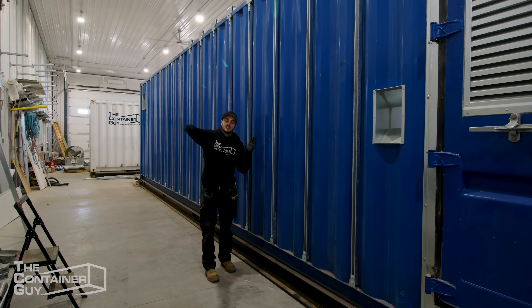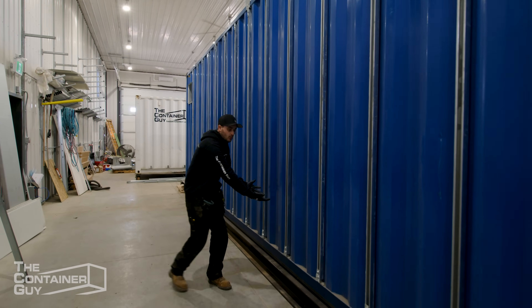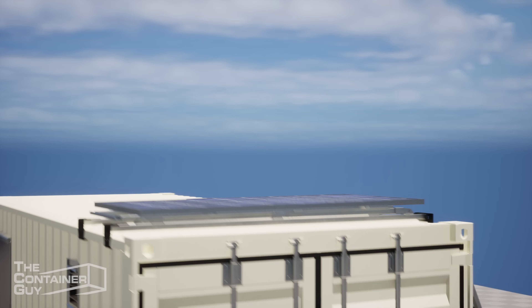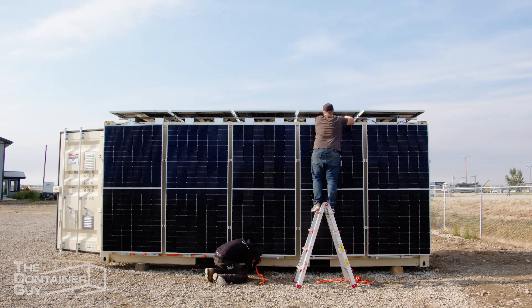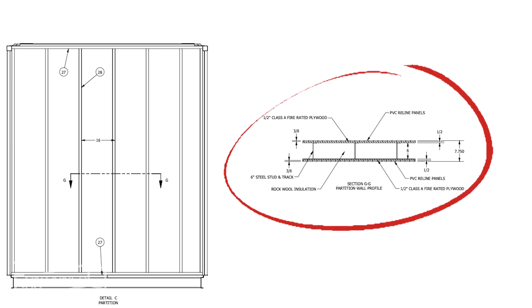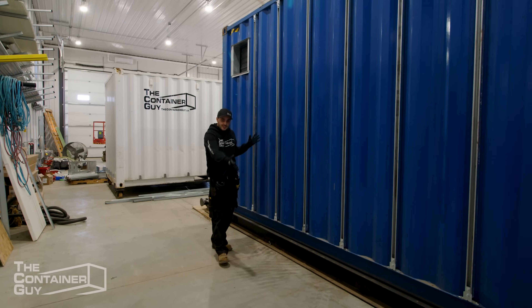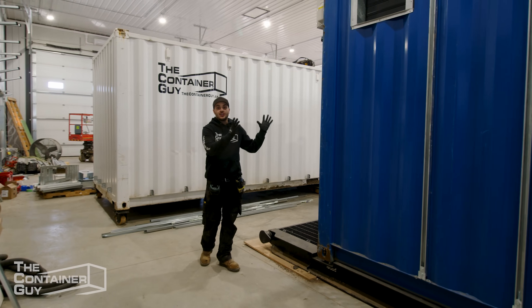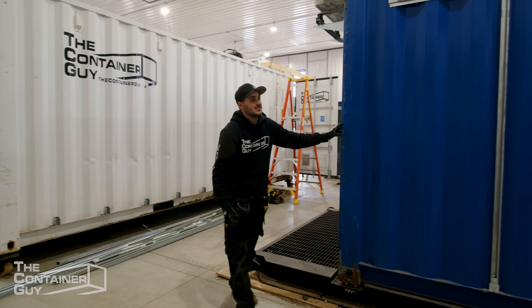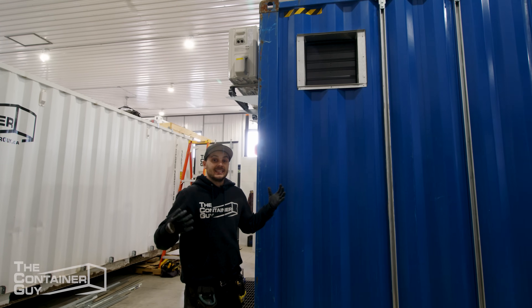It's way north, so it will catch the sun. They don't even want the panels to flare out. We have our kit that allows you to pull out one panel at a time and vary the pitch to follow the sun — as you get further south, you want a flatter angle. The generators are at the back of the container, with a two-hour fire separation: a partition wall that separates the nuts and bolts of this container. All of the electrical components are going to be in the three-quarters section that's fully insulated, and it is super well insulated.